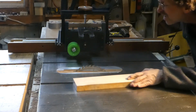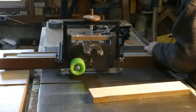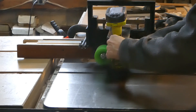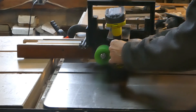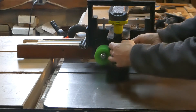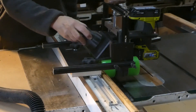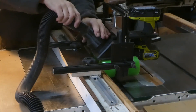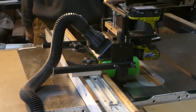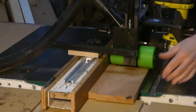Often hands-free or with minimal manual assistance for heavier work. The elevation hand wheel adjusts the feeder's height at 1/16th of an inch per revolution. It's powered by a brushless motor drill controlled by the provided speed adjuster on/off switch, allowing feed speeds as low as 3 feet per minute, up to as fast as the cut will permit. The feeder includes a dust hood for easy attachment to your shop vac.